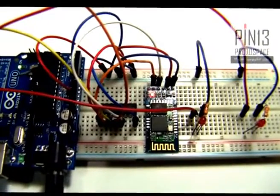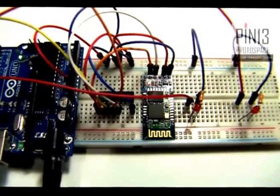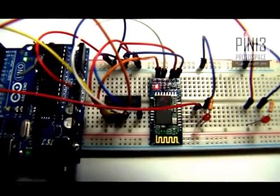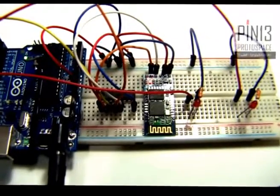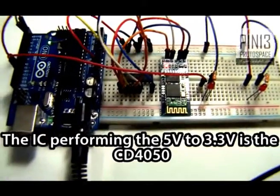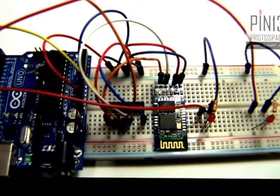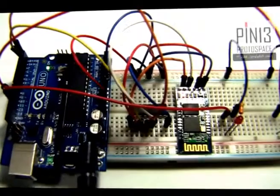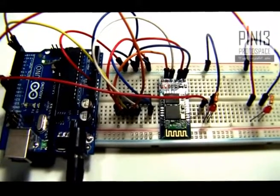There are two ways to handle this 5V to 3.3V conversion. You can use a voltage divider with resistor values such as 1kΩ and 2kΩ, or you can use a level shifter IC like the one I'm using here, also bought from eBay. In my other guides I've used voltage dividers and they worked fine, but here I wanted to try something different. I also have two LEDs connected to pins 11 and 10 — those are PWM pins, so I can control them with analogWrite as well as digitalWrite to turn them on and off.